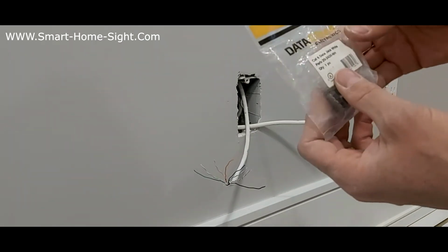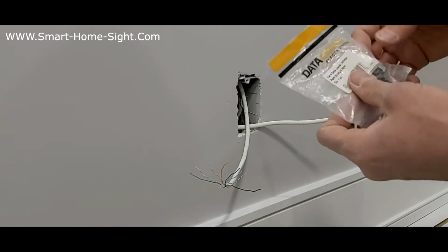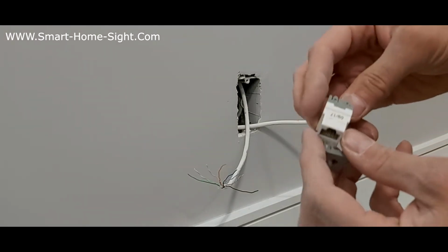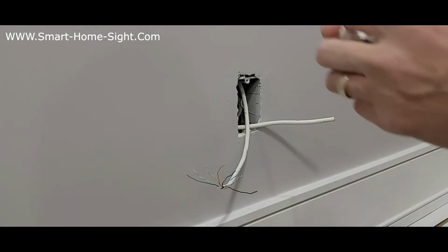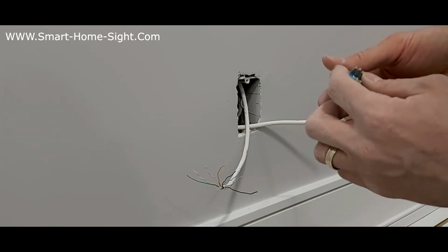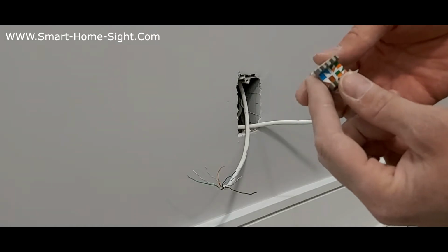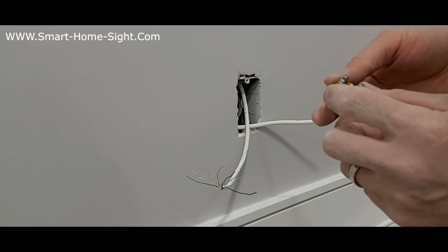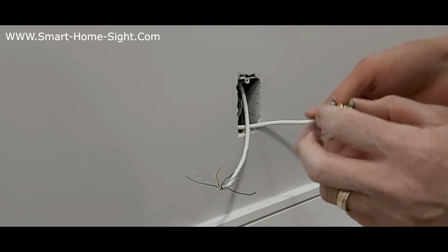This is a Cat6 data jack. There are different colors in the market, like white, gray, black, whatever. You choose regular, just white. Okay, this is the Cat6 jack, and this is a cover for the wires. We have 2 kinds. Depending on which protocol you choose, there is type A and type B, and there are different combinations. Personally, for some reason, I choose type B.